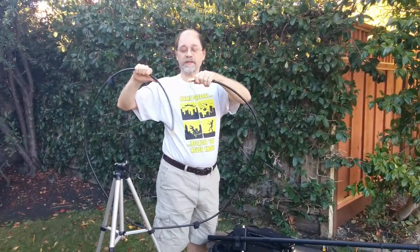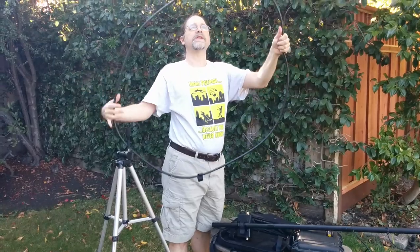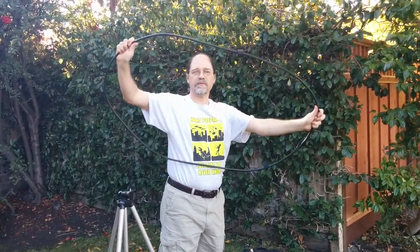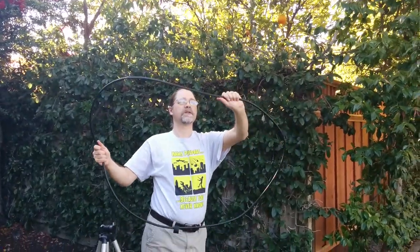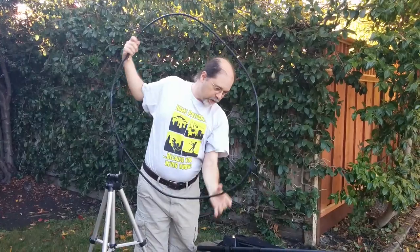Although you can make a magnetic loop out of any type of shape that's closed, such as a square, the area is what really matters. Even though the circumference is the same no matter what shape you use, the maximal area is obtained when the result is a circle. So I've taken a few seconds here to straighten this out into a circle, and I'll put it on here.